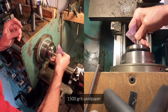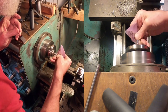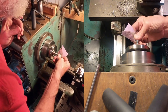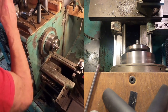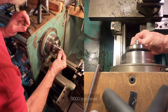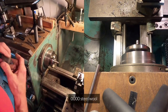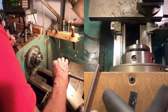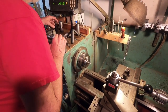And since the form tool is nicely polished, you can see the sandpaper brightens it up right away. I don't see any problems with this surface. Finish off with a little 4-0 steel wool. That's bright enough for me. That's pretty nice. Looks pretty good. Okay, so now